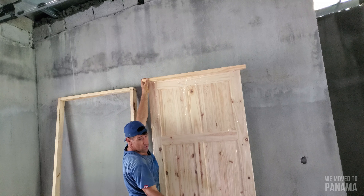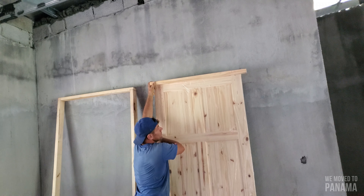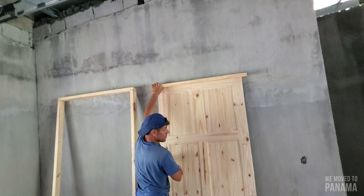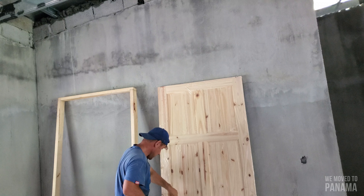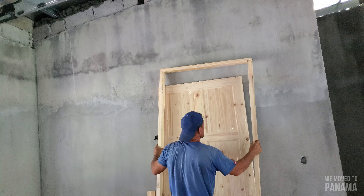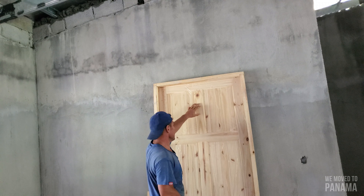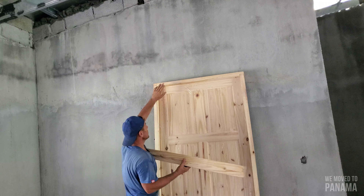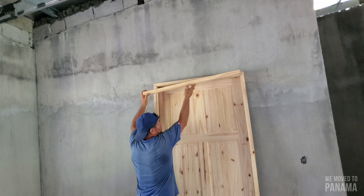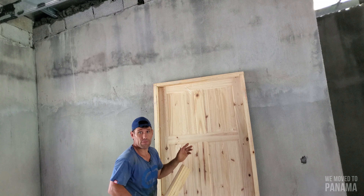This is the top part of the door that will go right on top. You need to make sure that the two side pieces are put into your door frame on the sides. These pieces haven't been cut yet, so you've got your loose piece that goes on top — put your two sides next to it. Then you measure the width of your door including your two pieces together.